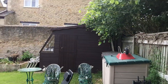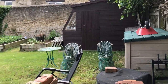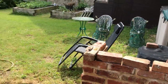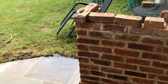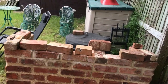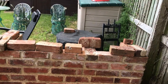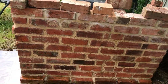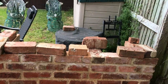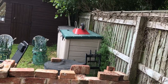Okay, so you get the picture. Now this was thrown together — no spirit level, no string lines, nothing. This here is natural hydraulic lime which was sitting around for goodness knows how long, and I've been reworking it repeatedly. What happens is every time you rework a natural hydraulic lime it loses some of its strength, because it's dependent on a hydraulic set. A lot of people think that once you've reworked a natural hydraulic lime it's no good anymore.